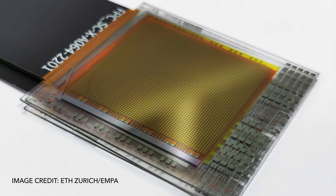And that's where a brand new sensor design comes in. It's been a long time since a completely new image sensor type has been developed for mass-produced cameras. But recent work by ETH Zurich and Empa has resulted in a sensor that could change absolutely everything. The fruit of over a decade of research, the new chip uses lead halide perovskite instead of silicon. Not only is perovskite easier to process than silicon, but its physical properties can be changed based upon its chemical composition. If the perovskite contains more iodine ions, it absorbs more red light; add more bromine and it absorbs green; add chlorine and it absorbs blue light.